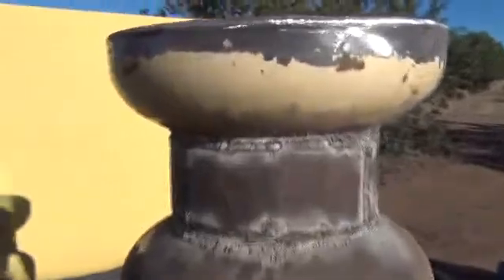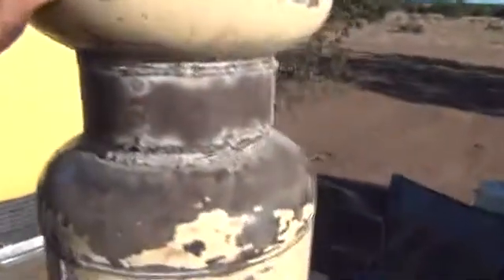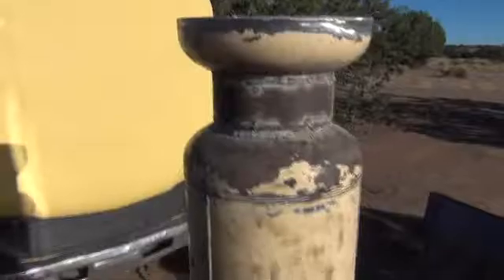The next step here is to go ahead and attach our screen up here. Let me fold this over so you can see what's inside. You'll notice I got one little offset hole from the propane tank lid right here where my fingertip is. I'm going to have to cover that with a piece of steel — I don't want to leave an air gap like that; that will be an off-pressure area. You'll notice in here that this actually reduces again. That's another reduction point — this hole is actually smaller than the inside diameter of our other reduction point, so it's a finalized reduction point before it goes into the ash container. This should guarantee a pretty good burn and clean gas out of the end of it.